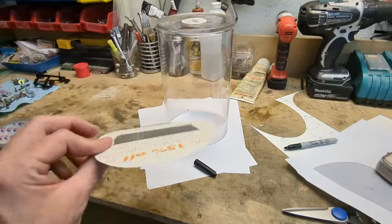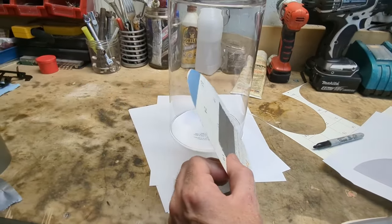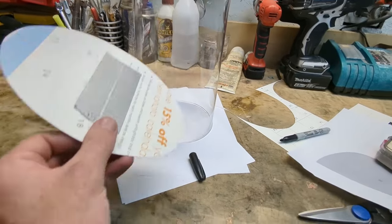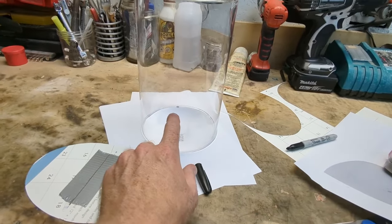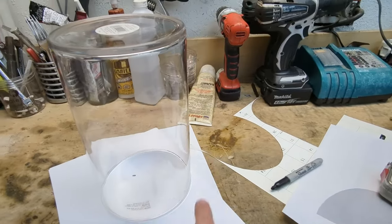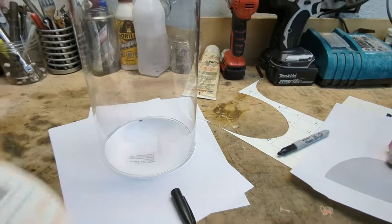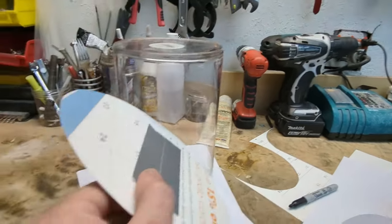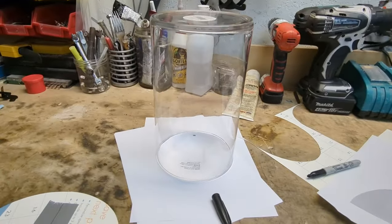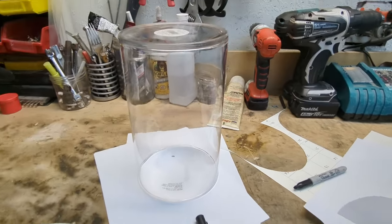Even with the egg-shaped screen maximizing the projection space, the reflected image will still only go about halfway up the jar. So what I've done here is I'm planning on cutting the glass jar. So I'm gonna score around the edge here, and that gives me about 6 inches. So hopefully where the egg sits in at the bottom, this is gonna come to about an inch at the top of the jar, just so that way the jar won't be that much taller than where the animation that's going to go on screen is able to play.